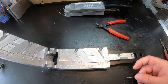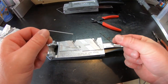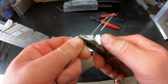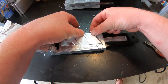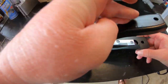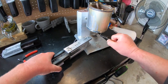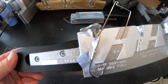We did a three-eighths and a half ounce already — this time we're going to do the quarter ounce. This is a size 2/0 hook with a thinner wire form. Connect the hook and wire form, take the pliers and bend down to secure that hook a little bit better, secure everything so they stay in place, close up the mold, go over to the lead pot, pour everything in, plug it back up, and we got a good quarter ounce buzzbait.